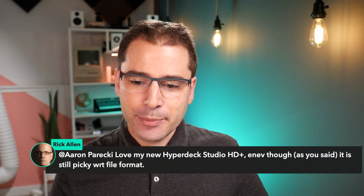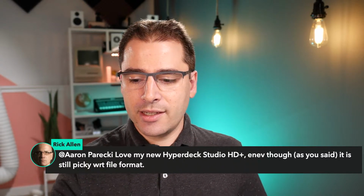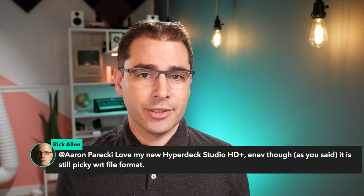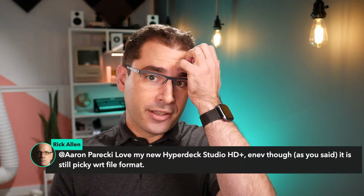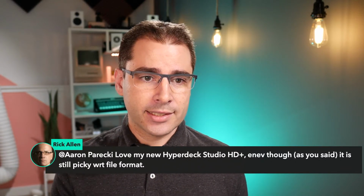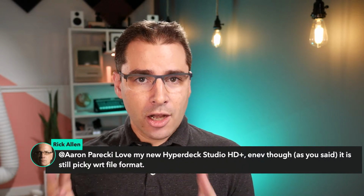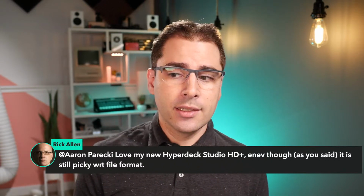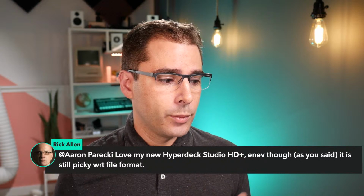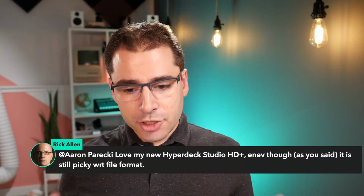Oh, Rick says, love my new Hyperdeck Studio HD Plus, even though, as you said, it is still picky with the file format. Yeah. It is the same deal as the original Hyperdecks, where it'll only play back certain kinds of clips, and all the ones on the card have to match as well. So you can't mix and match frame rates on a single SD card, because it expects you to be in one video mode, which makes sense because it's outputting a signal over its SDI port, and that signal has to be in some standard frame rate. So it would be awkward if that output were changing frame rates all the time based on what clip was playing, or the alternative would be there's some magic in the device that's scaling it on the way out, which I don't actually know if I would want, because then it becomes more stuff to manage. But it does mean that you have to be aware of all of the frame rates you're putting onto the clips as you're loading them into the Hyperdeck, which is just how it works.